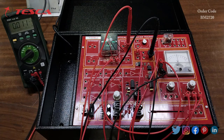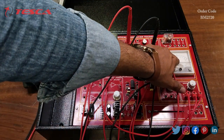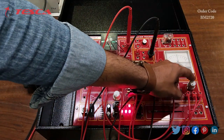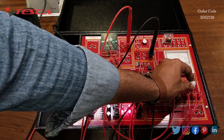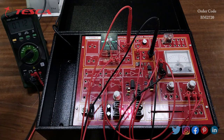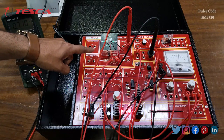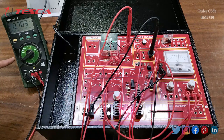Switch on the kit, but first keep the potentiometer at the fully clockwise position so the voltage reading is zero. Switch on the kit and vary the potentiometer in the anti-clockwise direction. Set the voltage to 2 volts. On the multimeter you can see the milliampere current value — for example, 0.7 milliampere — and you can see the lamp filament glowing.